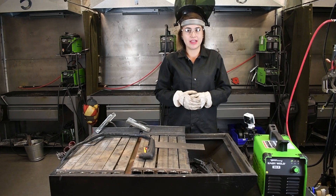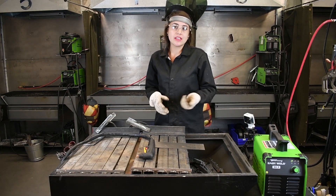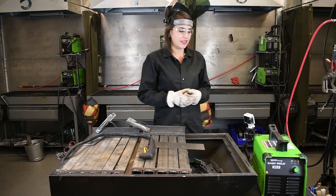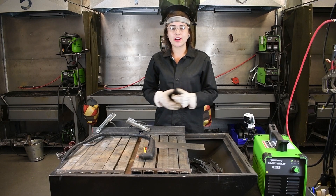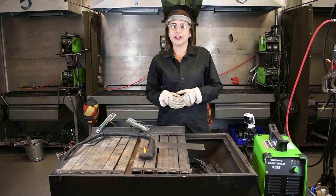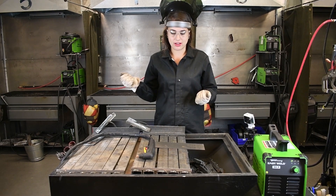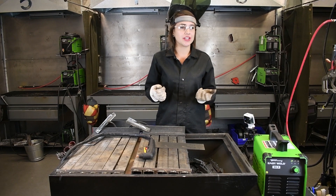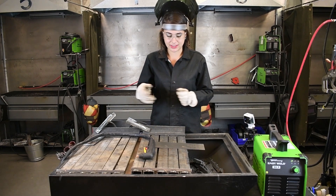Pretty much anything you may have already had in your garage. It also runs off of 120 volts, so as long as you have a 15 to 20 amp breaker, you should be able to cut pretty far with this machine before any issues with blowing a breaker. But if you're cutting a whole lot or for really long periods of time, you may want to make sure you have a 30 amp breaker so you don't have to worry about resetting your breakers.